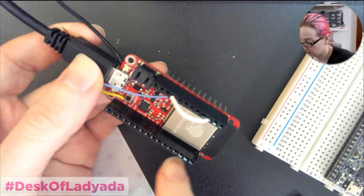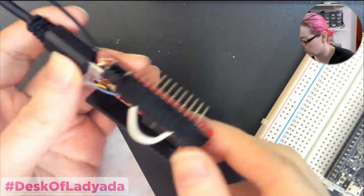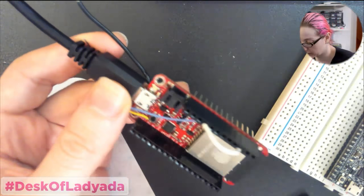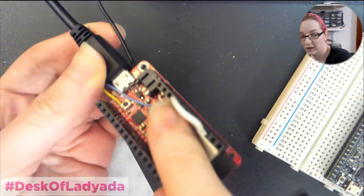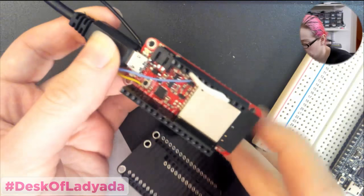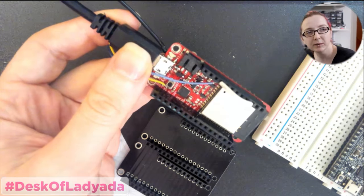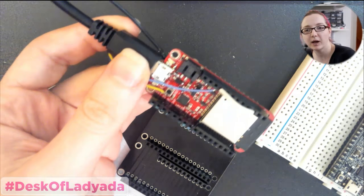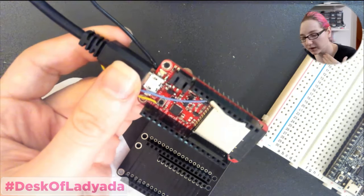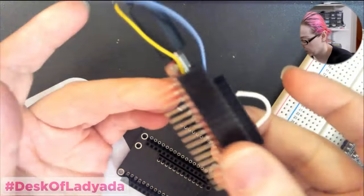And I didn't realize there are multiple UARTs, so I ended up swapping some UART pins in my next revision, and some pins don't do pull-ups, and I'm also learning about that. But it's a very new chip. It's like alpha, beta, very new, but it's a good time to start developing. I didn't want to start before about last week because so many changes were happening. I wouldn't want to release something and then have to re-release it with changes. I want to release it once, basically, and get it as close as possible to finished.